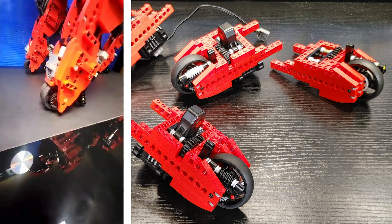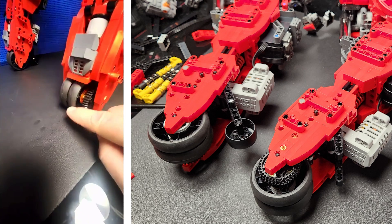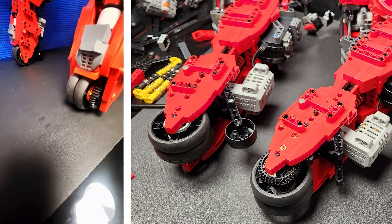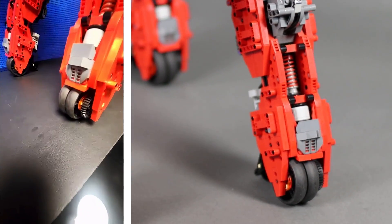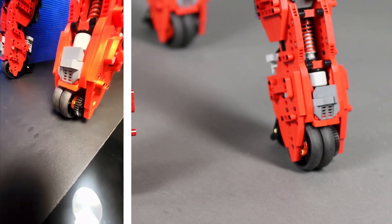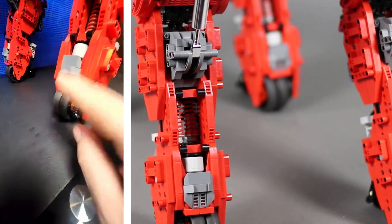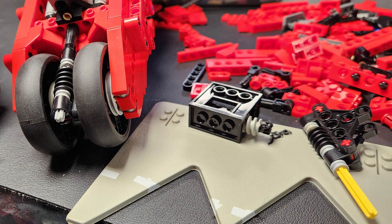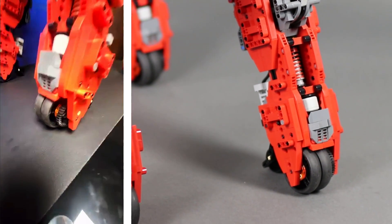So I have these. At first, the wheels were just a single wheel — just one wheel. I was definitely noticing some stability issues as I was starting to put the chassis together, so I decided to double up on it. I also melted a lot of worm gears trying to directly drive these with worm gears — melted them real fast, so I switched.